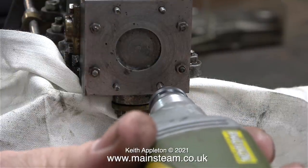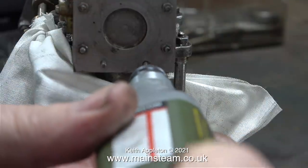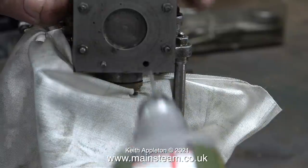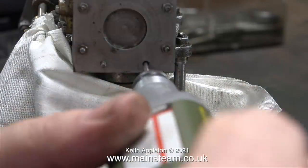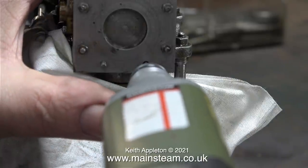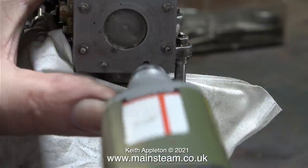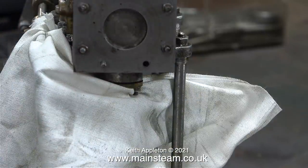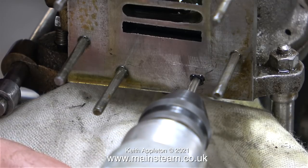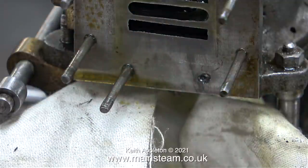In this clip I'm using a drill bit exactly the same size as the hole in the steam chest cover, attempting to drill a small centre in the end of the broken stud inside the block. This was utterly unsuccessful and burnt out two drill bits. In desperation I tried a third drill bit and sped up the drill - you can hear the horrible sound it made; it only destroyed the tip. I pressed on regardless with drill bit number four and removed the steam chest cover and main steam chest housing.